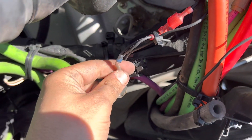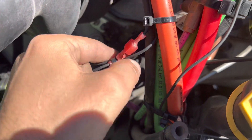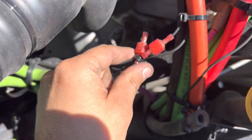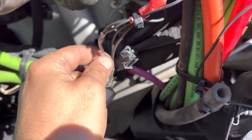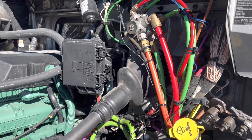The Ever Blades also come with switches, but you can cut those — all you need is up to this point. When you get those Ever Blades, you get two red wires. Cut it right here, connect those two red ones, and plug it directly to the power. That's how I did it.